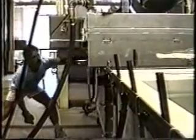The output on this machine is between 12 and 16 units per hour with two or three molds and 0.125 thick sheet. Notice the square corners. We do not have to have the rounded corners like you see in many units. The square corner makes door installation a lot easier. It also affords you more room inside the unit.